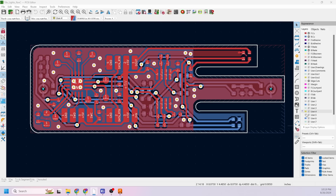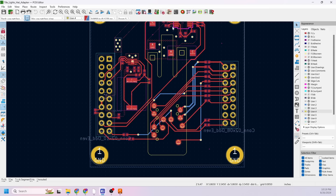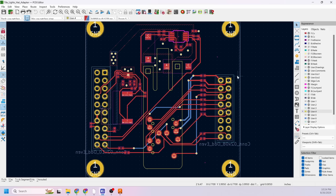The first thing I did was open the KiCad file for the target PCB and add the board outline and a circle representing each pad location to a user drawing layer. I then copied and pasted this over to the pogo pin board design so that I know exactly where the board would sit and where each pin would be. This made it very easy to align the SMD pads for the pogo pins, but a quick word of advice: double and triple check that the layout is mirrored correctly, because the top layers of the two boards are going to be facing each other. At first I made this mistake and actually laid out the entire board before realizing the pads were flipped. Once that was corrected, I connected each of the pogo pins to a pin on a standard one-tenth inch spacing header, and I also laid out a couple of other circuits that I'll get to in a second.